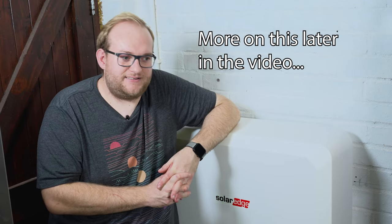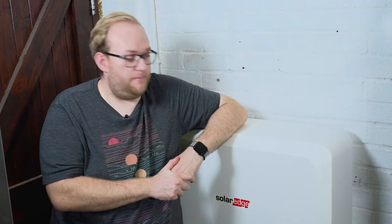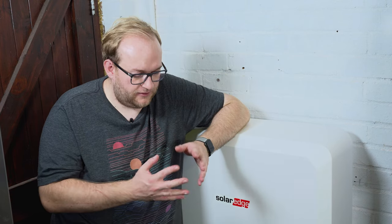After that point we realised we had to make those changes to the system, but once we'd done that and got the system back online, the battery has been functioning perfectly and so has the inverter. A bit of a spoiler: in the previous video I talked about how four kilowatts was the max we'd produced at any one time, and I was a bit disappointed, expecting it to be five. Well, since we split it into two strings, we've actually had seven kilowatts. As an owner with the battery, you don't get a huge amount of control at the moment — in fact, you get none. I'm hoping that's going to change in the near future, but if you want to change the profiles, your installer is going to have to do that for you. It's a bit frustrating, but I'm pretty certain that will change in the not too distant future.